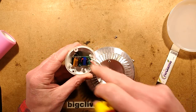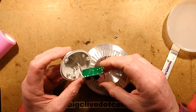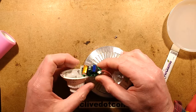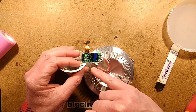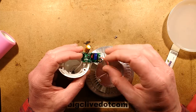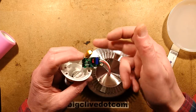Let's short that capacitor out first. Yeah, that's it dead. Let's see if we can get that out — well, that wasn't too hard. So we've got the main board. There is a 400 volt 10 microfarad capacitor, there is the ubiquitous little chip. Now I'm seeing an extra little capacitor here, so it's not one of the Bright Power type chips — it might just be a different version for higher current loads. It's got a bit of direct rectification, the smoothing capacitor, the dedicated chip.